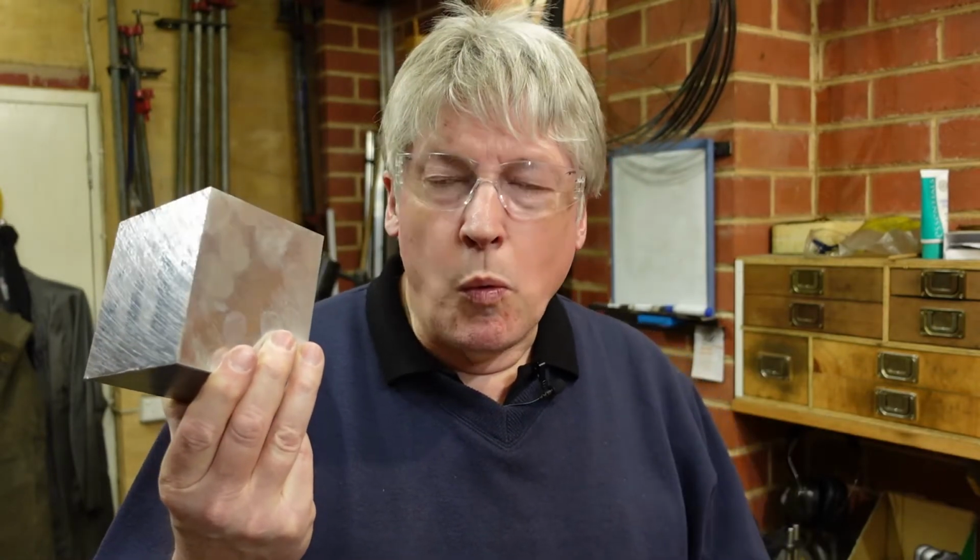Another thing that people forget about is the cost of materials. Steel is relatively cheap, but things like aluminium aren't. And so this particular block here, it's 100 millimeters by 100 millimeters by 80, so it's not enormously big, but that's $20. Now I had someone come up and say, can I make them a bracket for whatever it was? And when I said, well, for a start, the materials are going to cost you around about $30 to $40, he suddenly retreated because he was expecting something that included my labour, probably all up $20. If this was a lump of wood, that might be actually true, but metal is expensive. Steel not so much, but when you start getting into aluminium and stainless and always coppers and bronzes and brasses, things like that, the cost soon mounts up, and that's even before you take anything off.